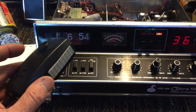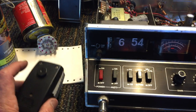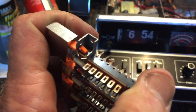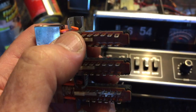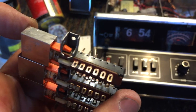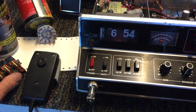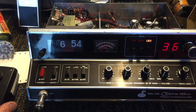I began thinking maybe I've got a bad microphone or maybe the contacts are corroded inside. I've seen that happen before where the little push switches inside the microphones would go bad, because they had a multitude of normally open or normally closed switches. So when you push your microphone button down, sometimes there would be too much corrosion inside. I grabbed a couple of different microphones, put them on here, and that still didn't solve the problem.